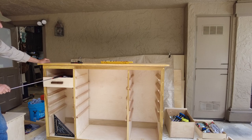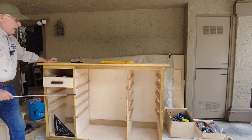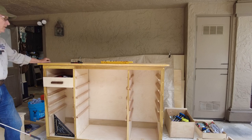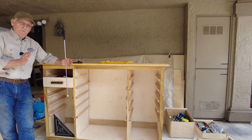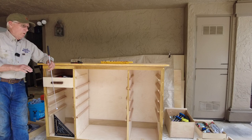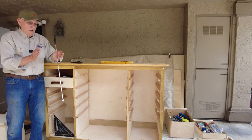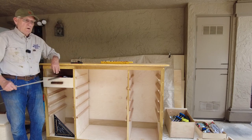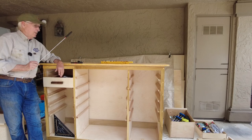One more mistake discovered during the autopsy: I had all this beautiful Baltic birch plywood with Baltic birch edge banding almost everywhere. I took some boards of the same material and tested a lot of different finishes to decide what would look good. But the mistake was that my sample pieces were too small. I put down different finishes — for instance, the Watco Danish oil I put on one piece looked kind of like what I wanted and didn't appear to change the color much. But the samples were too small and side by side they didn't look that different.